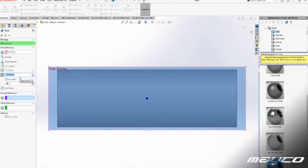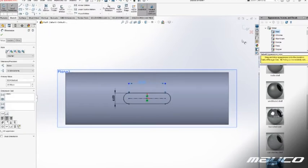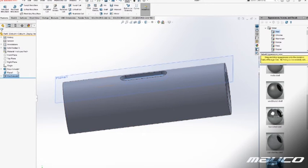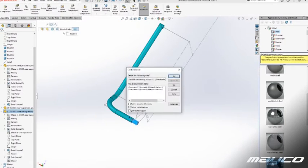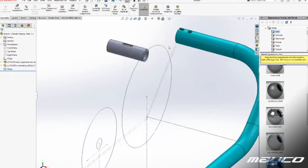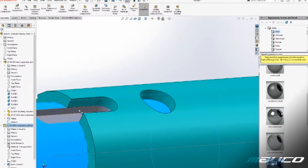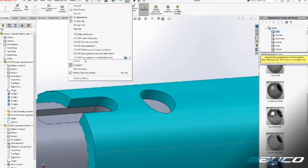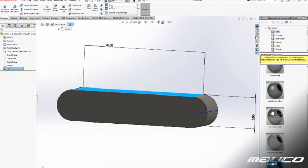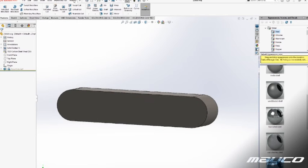I have not done that in this video. I've done it in a later video, but then at least you know that I already thought about it, and that I was working on removing that bar or at least changing the design of the bar so I could get more space. Also, that bar was quite complex with several bends in it. And I now took a little bit thicker plate and just simplified it a lot. It is generally used to just hold the ends together because the roll bar already braces it left to right.